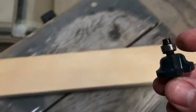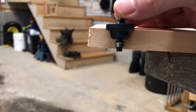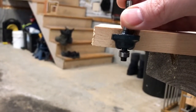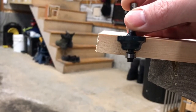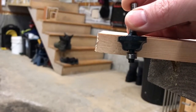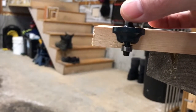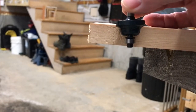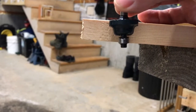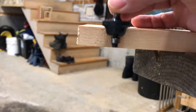The key trick is you want to make sure your bearing is riding against solid material. When you set your depth on your router, make sure your bearing is not going to be lower than the wood surface, because then you'll just dig in and won't get the profile. I made it once where only half the bearing surface was riding the edge and that made the edge too thin and it started chipping. You need 100% of the bearing surface touching the wood.